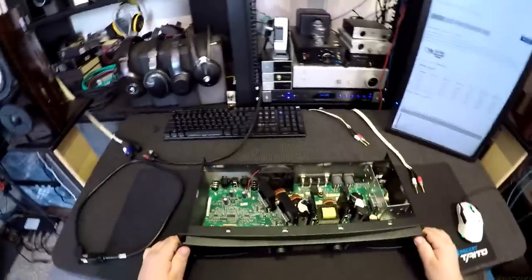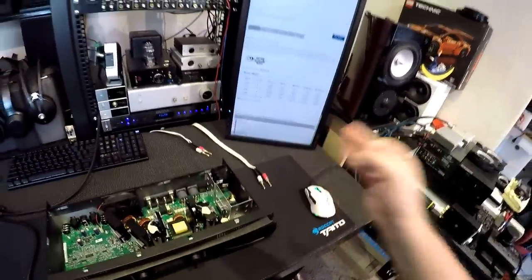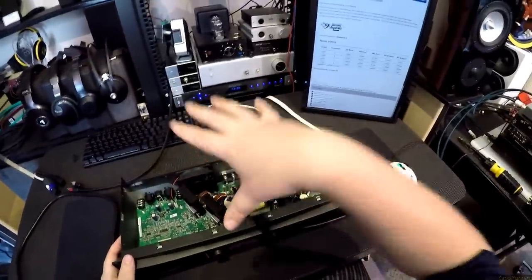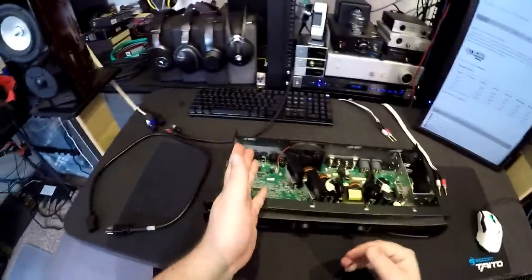This model at 8 ohm — which is normal speakers like you have on a desk — is 300 watts a channel. You can bridge this to a single amplifier like I have in my living room. I have two of the A500s; those bridged at 8 ohm are 600 watts. This bridged at 8 ohm is 1050 watts. 4 ohm bridge is 1550 watts. It'll also drive in stereo to 525 watts at 4 ohm and 775 watts at 2 ohm, which is how I was wiring it up — just in stereo, 775 watts per voice coil.